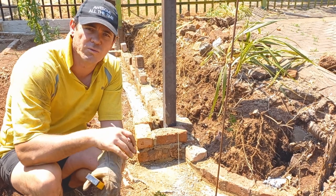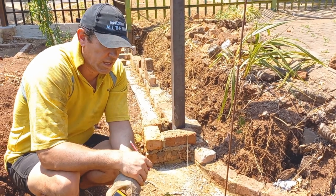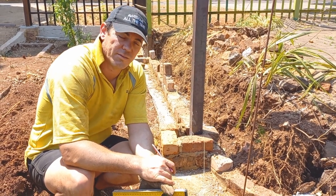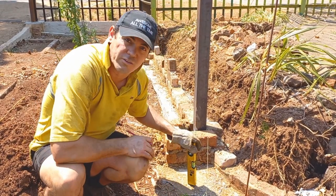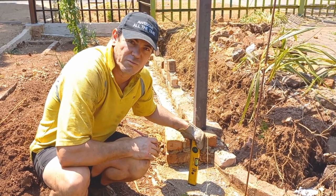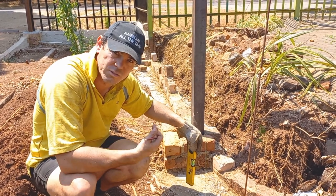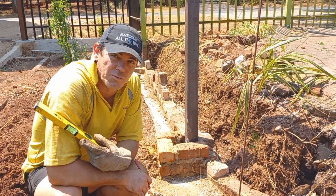So we got some beautiful volcanic rocks here in the garden that the previous owners brought in. Thank you to them. And we're going to use some of them to fill the bottom. Otherwise the bad guy is just going to crawl underneath and get in anyway. We don't want that. So it's difficult because you want to balance. You don't want your palisade to be on the ground because it's going to get wet, stay wet for longer, and rust is going to happen from the bottom up. And you also don't want it too high because then they come in. So what you want is a nice balance for water to run off and no one to be able to climb in underneath. That's what we're looking for.